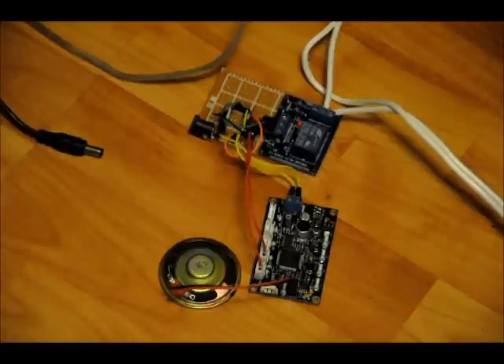This is a custom project I put together for a customer. He wanted to be able to turn his light on and off using a sequence of commands. So what I did was I programmed a microcontroller connected with a relay board, interfaced with the outputs of the ES6928P voice recognition system. He wanted two commands that have to be said side by side in sequence — output 1 and then output 2 — within a certain amount of time, or else the lights will not toggle.